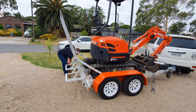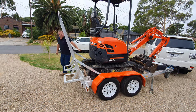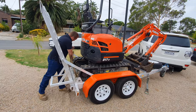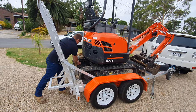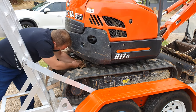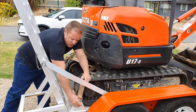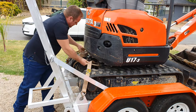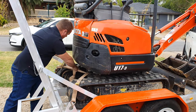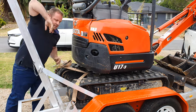We've got a strap here that we've cut off before. Make sure there's no twists — the shackle goes up there, the end of the strap then goes through the bar just there, across and then back in there. Once that's on, pull the slack out using this from here, and then simply do the ratchet up. And that's tight for that.